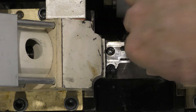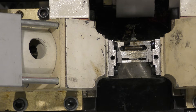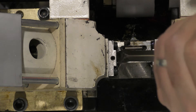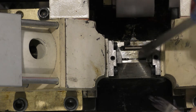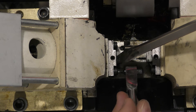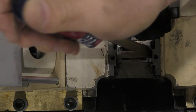Install the light lock nozzle tips, but leave the screws about a quarter turn loose. In the conveyor width screen, jog the side nozzle heads in a few times. This, combined with the pressure on the side heads, should raise the side nozzles up off the bottom nozzle plate. Using a large flat screwdriver, push the nozzle tip towards the exit end of the extruder, then hold down on them while you tighten the three screws that secure the side nozzle tip. Repeat this on the opposite side. This will seat the side nozzle tips against the bottom nozzle plate, minimizing any leakage between the two nozzles.